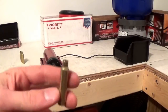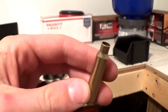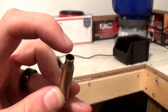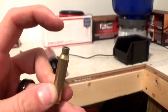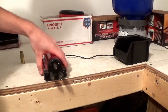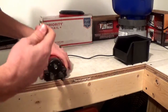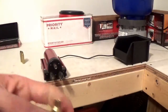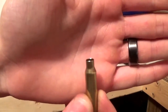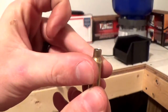As you can tell, this has been trimmed — it has a flat edge on it, has burrs, a sharp edge. You want to make that sharp edge go away and also clean up the inside so it's easier to seat the bullet. I've got a Hornady Case Prep Trio. As you can see, it now has a nice fine edge — no sharp edge anymore. It's a smooth, cleaned-up case.